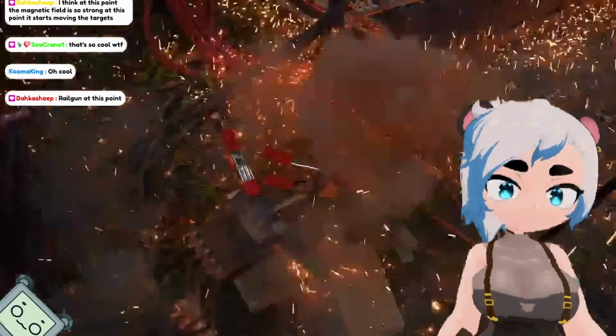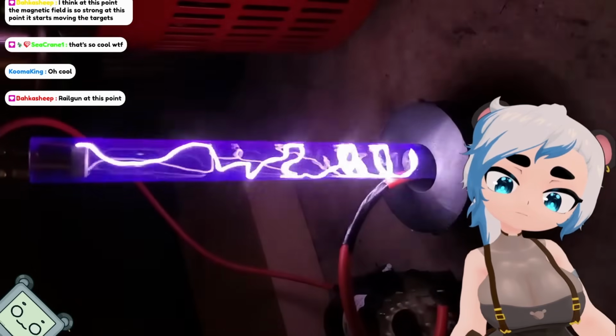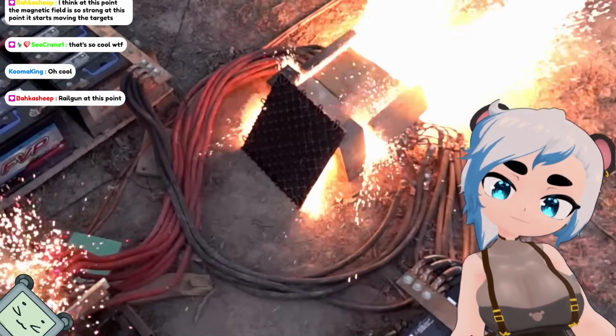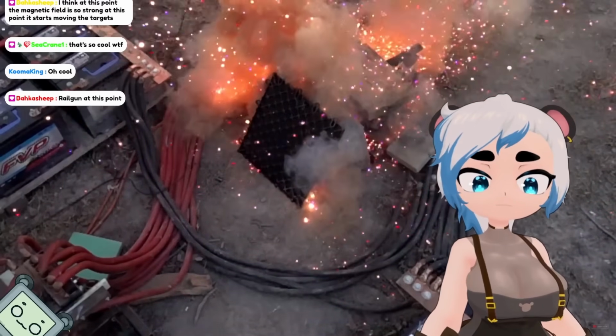Now this has a lot of interesting consequences in physics. It's why lightning pinches itself into a fine streamer, and it's also the basis of experimental Z-pinch fusion reactors. In this circuit, it causes the aligned cables to bunch up, while repelling the cables carrying current in the opposite direction, and this is what's ripping apart the copper blocks.